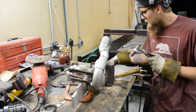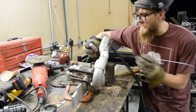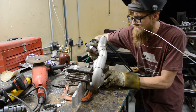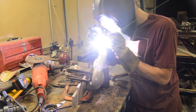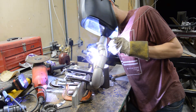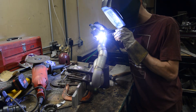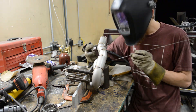Alright, we're back at it — Corey's mad he lost. I'm running 100 amps DC. Now I need to drop a couple tack welds right here and then we should be good to start welding.